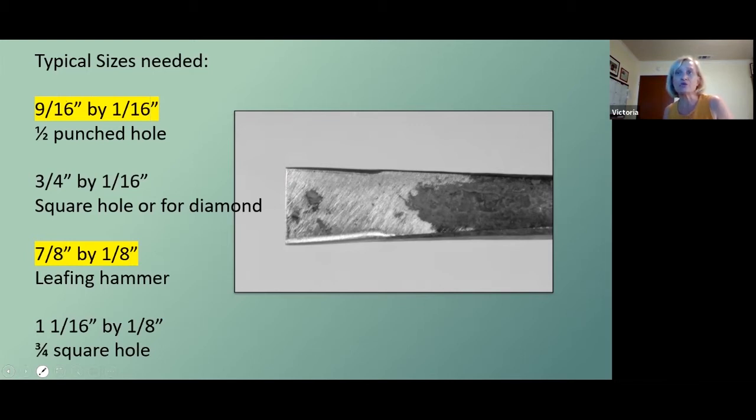Keeping this edge a little wider — these are consumable tools; you're going to kind of go through them and they're going to get smaller, or you'll need to make a new one. They only have so much life in them, and how you use the tool will dictate how well the heat treatment and ultimately the tool holds up. You would heat treat this just like we did the chisel, using the same process. It's about the same size so everything should be relatively similar.